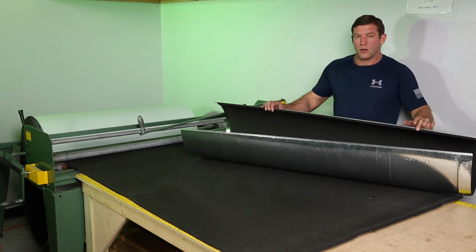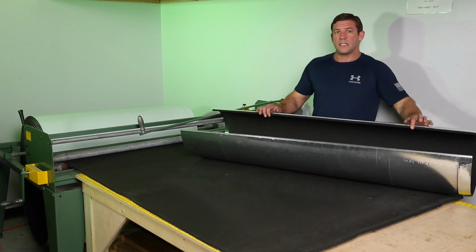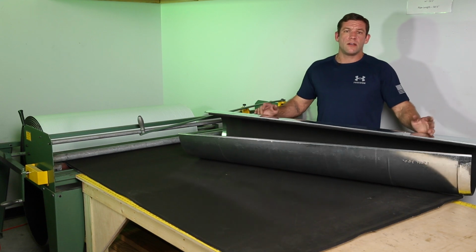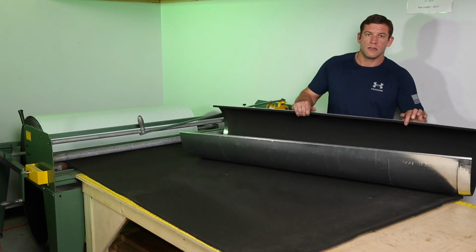And what I want to mention about Armaflex before we even get far into this is it's a very tedious product and it is not forgiving. With fiberglass, if you tear the insulation or you mess up a seam or something, you simply put a piece of duct tape over it, you put some mastic over it, nobody knows the difference. It's done, it's fixed. With Armaflex, if you make a mistake, you're normally throwing this material into the trash.